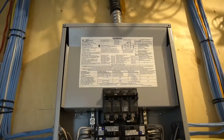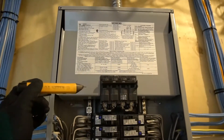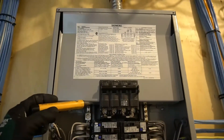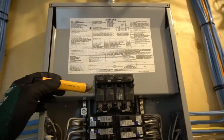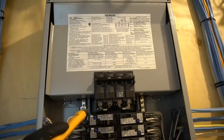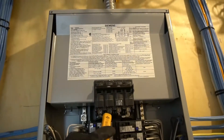There are many different panels, but they are very similar. Let's pretend my breaker is off right now. Even though it's off, it still can be very dangerous. It is very important you do not touch any bare metal or copper showing above the main breaker handle, because it is still alive — there is still electricity running through it. Do not touch these bare metal parts.